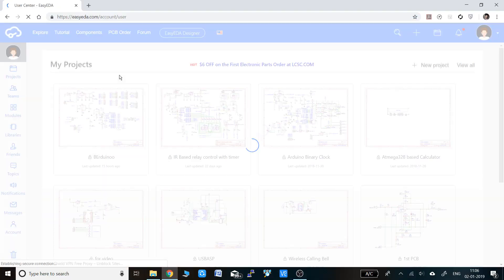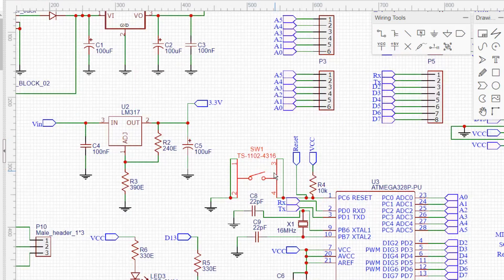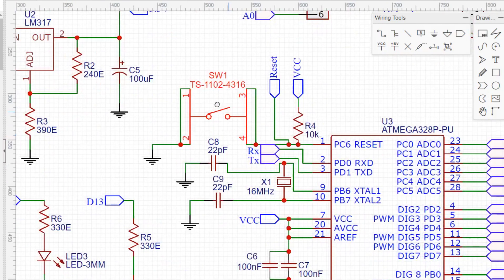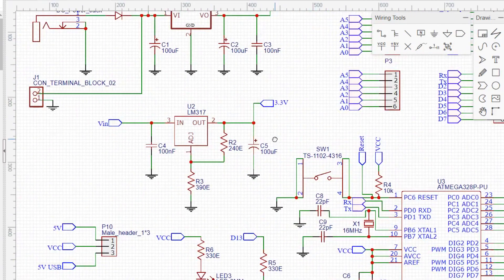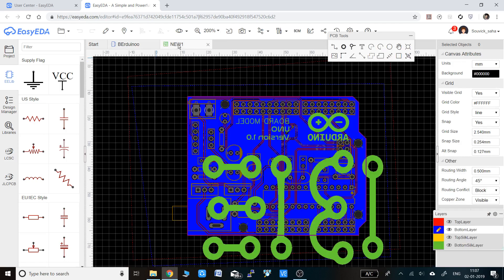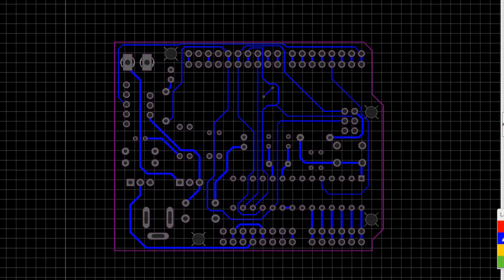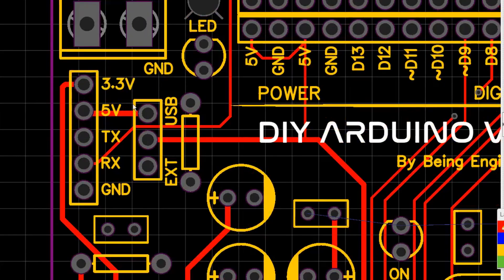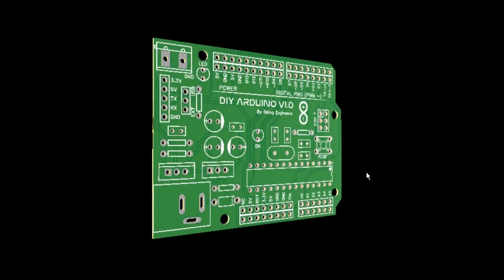Now after making all those changes, it's time to draw the final schematic. For this, I use EasyEDA — it's a great tool for drawing this kind of big circuit and makes life a lot easier. I've been using this tool for a long time and will recommend it to everyone without hesitation. The circuit diagram is in the description box as a PDF. Once the design is done, save it and convert the schematic to a PCB. Be patient with PCB designing because a mistake here can ruin your whole PCB. Check multiple times before generating the Gerber file. Don't use 90-degree turns to connect two pads. Also use copper area as ground — it's always good practice. There's also a 3D model tool you can use to check how the PCB will look when it comes out of the factory.